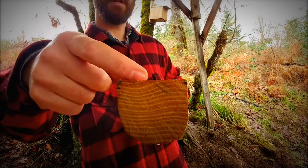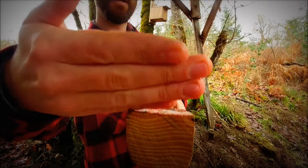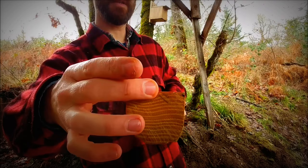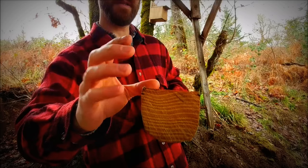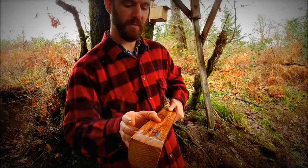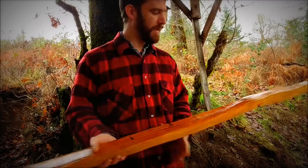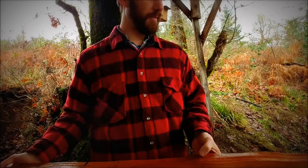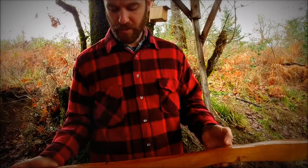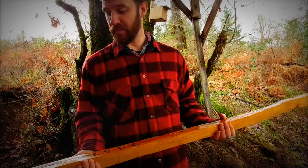So we're going to have to use a curved tool to scrape out that area. If we use the flat draw knife to rip off that, we're going to be cutting into the ring on other parts of the stave, so we're going to have to be careful on this end. There are also going to be a few pin knots that we're going to have to work around, as well as a slightly larger knot up here, so I can show how to deal with running into a knot on the stave. This is a good stave — it's not a premium stave.